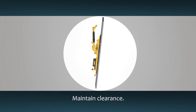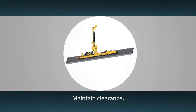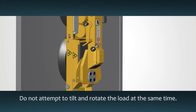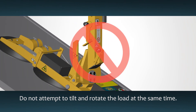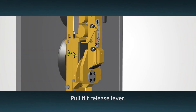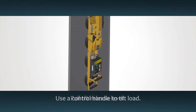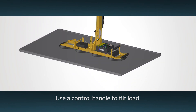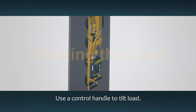Make sure there is enough clearance for the load to tilt without hitting the operator or nearby objects, and keep a firm grip on one control handle. When tilting a load, do not use the rotation lever at the same time — this can cause unexpected load movement that could harm the operator. Pull the tilt release lever to free the tilt latch, then lift up or press down on a control handle to tilt the load. The pad channel automatically latches when moved to the vertical position in order to stabilize the load.